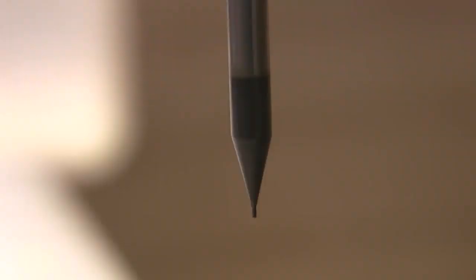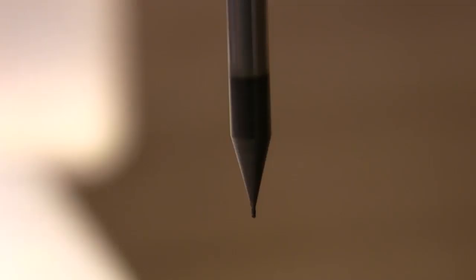The spindle is fully assembled. We're looking at a 1/64-inch bit — powering up the supply and revving it up, you can see it almost doesn't look as if it's turning at all. That's very low run-out. It's an extremely accurate, very low-cost spindle. When it stops it looks essentially the same as when spinning. That degree of stability means when you mill with a 1/64-inch bit, you actually get a 1/64-inch trace — not wider.